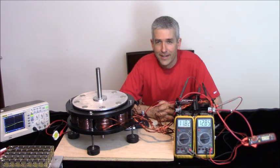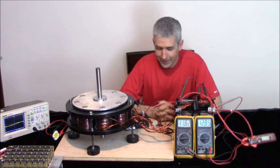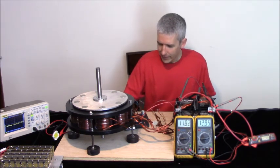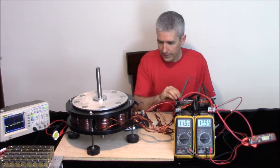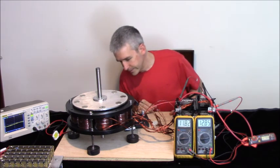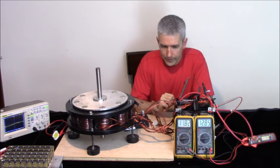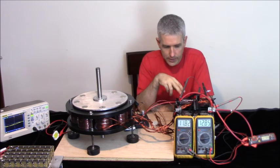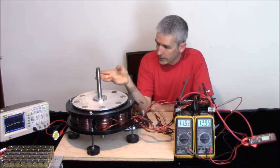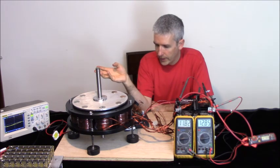I'm Rick Friedrich, and today we're going to look at the same kind of thing that we looked at last time, but this time with the speed control and the bigger FET and the fast diode here. So what we have is 12 volts right now, and we're going to run this. The one battery is pretty charged, the other one's discharged. We've got the oscilloscope hooked up just on the drain.